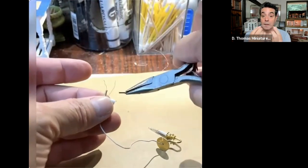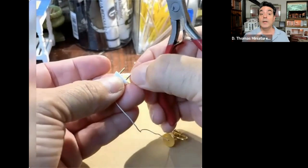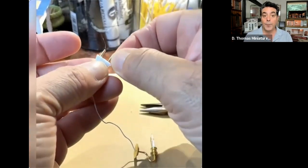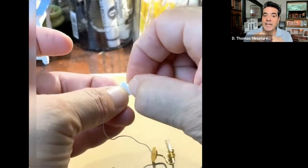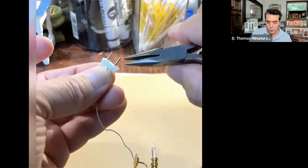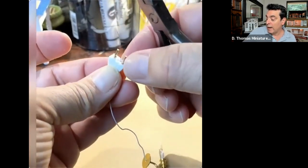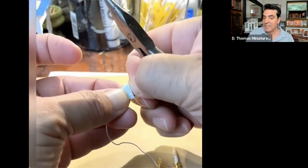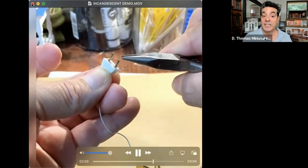Connecting your lights individually allows you to go in and fix it later on very easily. So what you're seeing here is how easy you can connect the plug to the light. You're pulling out these pins and connecting the wires, rolling them around, reconnecting the pin, putting the pin in, and then you have a tight connection. It's really, really, really that simple. That is one of my recommendations any time you want to set up a lighting system, or even one light or two: have it connect individually so that it makes your life much easier later on.